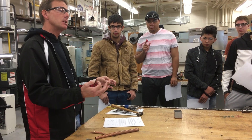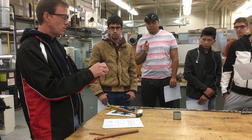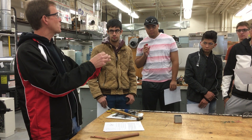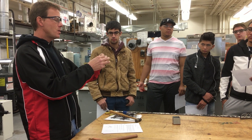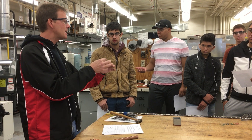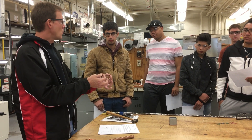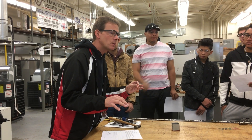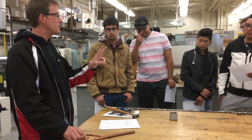You're going to get a handout on flaring. The flare nuts — when making a connection with two flare nuts and a union — involves about six, seven, eight dollars worth of parts. Each flare nut's about two dollars, and then the union's another couple bucks for the brass. When you add all that up plus the time it takes to make the two flares, we're getting into some money, whereas a swage joint doesn't require any extra material whatsoever. But it does require some tools, and I'm going to show you two different ways to make swage joints.